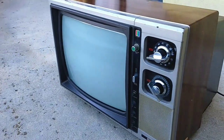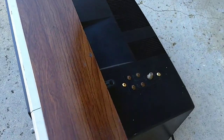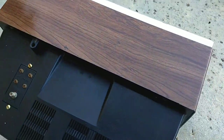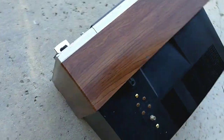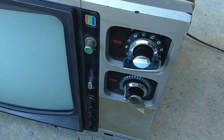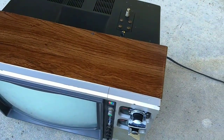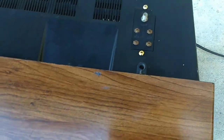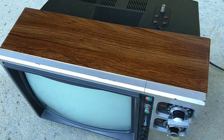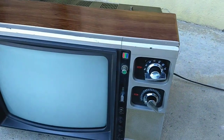Alright, so here she is all cleaned up. You can see it turned out pretty good. The cabinet has a nice glossy finish now. The faded black plastic actually looks fairly decent. There's still a couple of dings here and there, but it otherwise turned out very nice. We cleaned up the fake chrome on the knobs. The little aluminum grill was still soaked and tarnished, but it's okay. Lots of toothbrushes and Goo Gone got rid of the nasty stuff on the back cover. The top I cleaned with Windex, then polished it with Novus No. 2 plastic polish — same with the chrome on the knobs. The rest was just toothbrushes, Windex, and lots of paper towels.